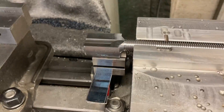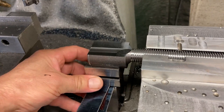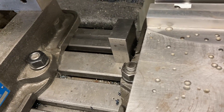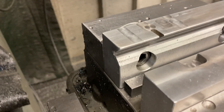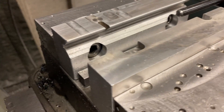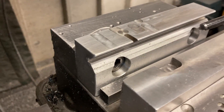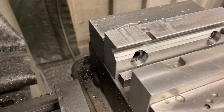I'll take my stack-up of blocks out of here and take the part out of the vise. I'll show you the jaw with the vise open — aluminum jaws, soft jaws. That's why it's got those notches in it — I cut that V in it. That way I can load them in there, don't damage the threads, and repeat to the same centerline pretty much every time.